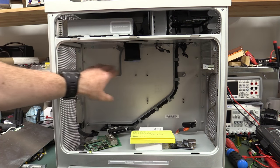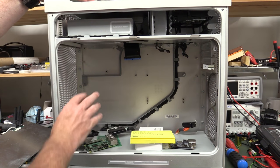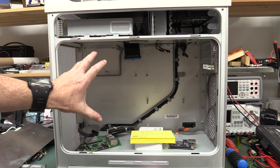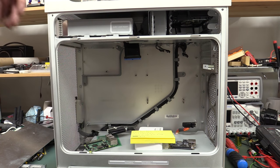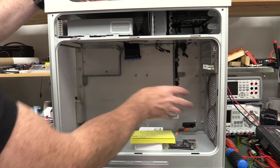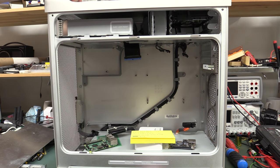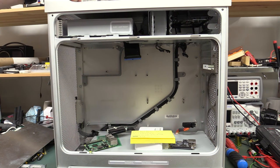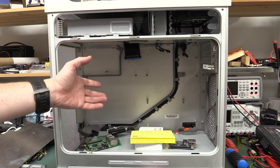I want to lay out the motherboard, of course. So the next step will be to get all the dimensions, measure it, lay out the motherboard, and then start planning. Often, when you've got that PCB template in your CAD software, you start playing around with modules and see how they fit. You could even do a paper or cardboard mock-up like this.